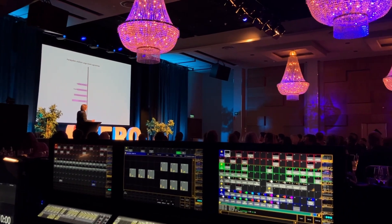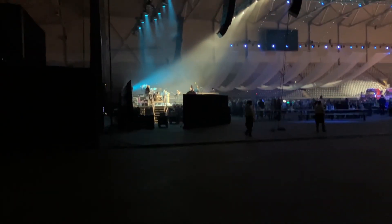A situation when you might want to use front fills is when you have a larger stage. If you have a conference and the people in the center can't hear the speech properly — say a 10-meter-wide stage with people sitting right at the front — that might be a good time to grab a conference speaker or a stage monitor, put it in the middle and connect it to your mixer. Ultimately, you need to decide if it's going to better the audience experience. You need to understand how your speakers project sound and how the new speaker will interact with existing ones. If it's going to eat into your sound check, maybe it's not that important.